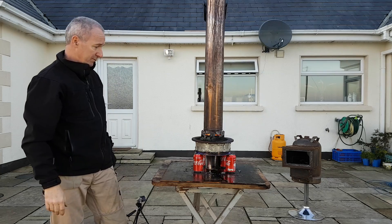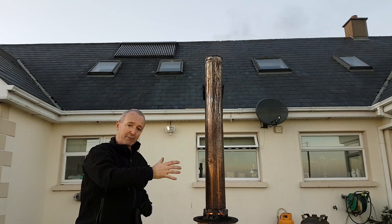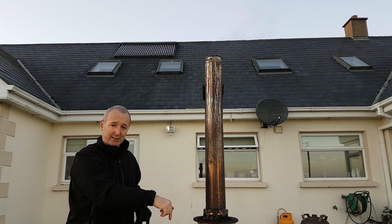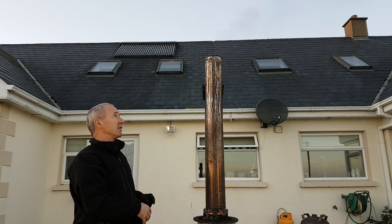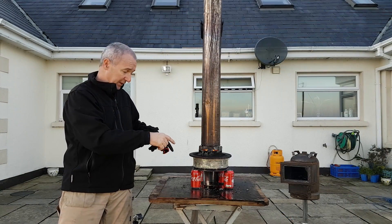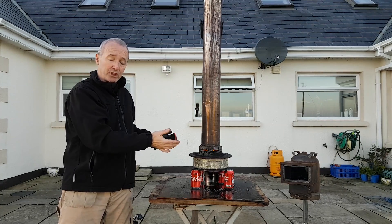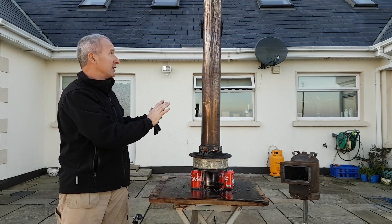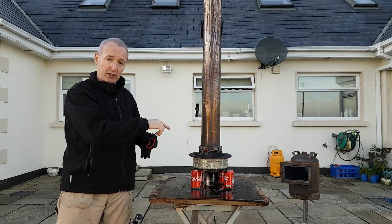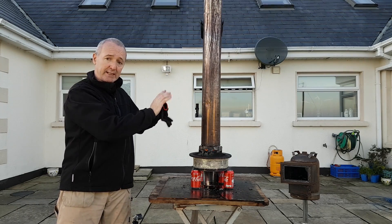What I need to do is put a second length of flue on this, extend it, and I'll have more suction. I might even seal around here, but there's great heat off it. What I'd like is to get it to go red. There's flame actually coming out of the top of this. If we put the second layer of flue on and make a more permanent burner unit this would be great. The smoke is because it dropped its oil onto the deck — that whole thing is red. So with just four items — a dog food tin, a biscuit tin, a car brake disc, and some flue — we made a functioning waste oil burner. This was really easy to do and the heat off it is brilliant. In the next video I'm going to introduce a drip feed oil system so we can control the fuel, and I might even make one out of steel.